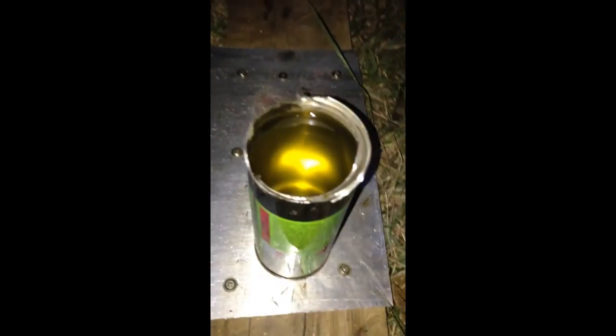What you want to find is a metal container that's not going to catch light when the oil ignites, because it will inevitably happen. I'm just going to use an empty gas cartridge that I've cut the top off with the angle grinder. Get a wire and wrap it around the knife - I've conveniently got a hole I can put it through - just so it makes it easier to dip into a can of oil. Heat this up until a magnet doesn't attract to it anymore, then dip it into the oil until it's cooled down.